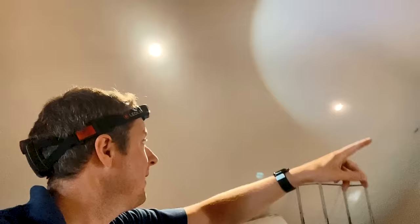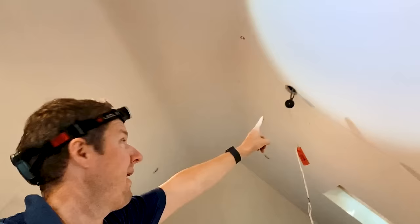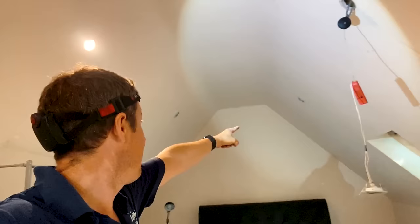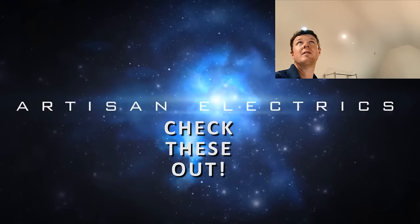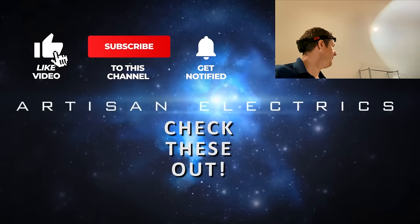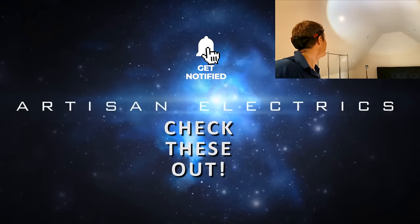Slight update before we finish - the way they'd wired the lights was different to what I thought. They basically went from one side to the other like that, so it was actually the cable from that light to that light that was problematic. From there it goes to that light over there and then back across to that light, and those cables are fine. So it's literally just the one cable between those two lights that's the problem. It's going to be really tricky to rewire it, and unfortunately it also means those two lights are not working now, so half the lights in here are not working. Anyway, things are not always quite as straightforward as you think - the brain of another electrician and how they wired it compared to how I would have wired it. Thanks for watching and have a great day.